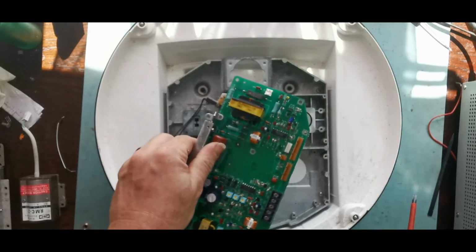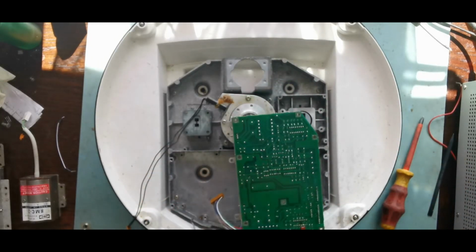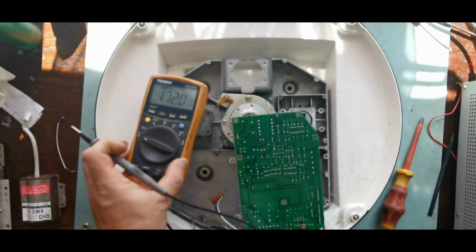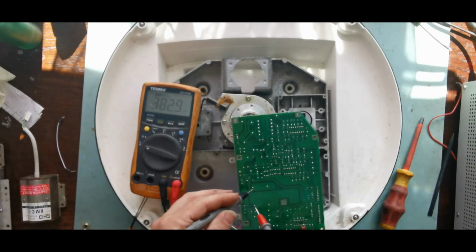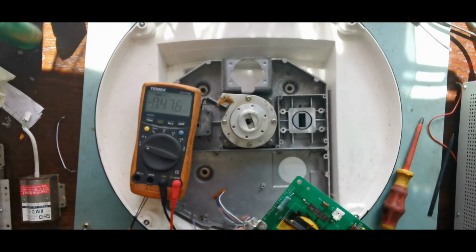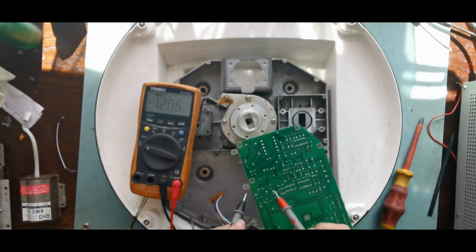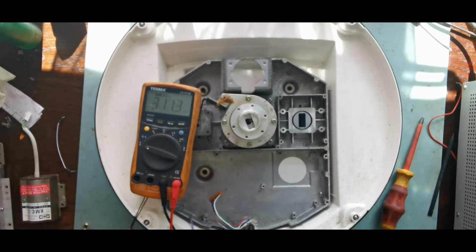Okay, right, I am so not putting my fingers across to that cap. Here goes my mouse. This is a very large capacitor, and I would like to make sure it's not about to give me a surprise. Nope, nothing there. It's not really anything on the output side, and those caps should be all fairly low. Right, that's all discharged. Cool, put that aside.